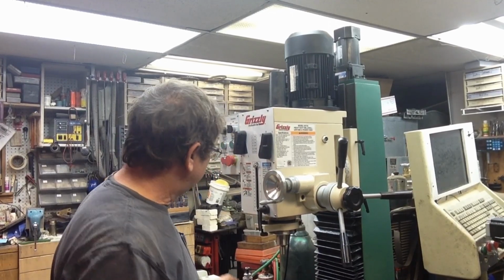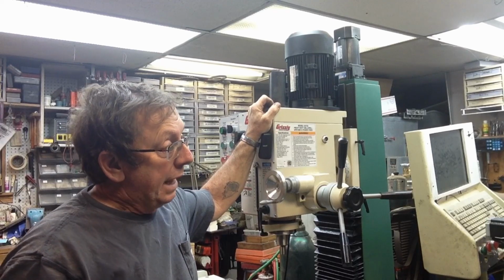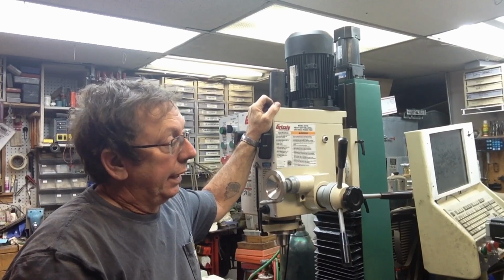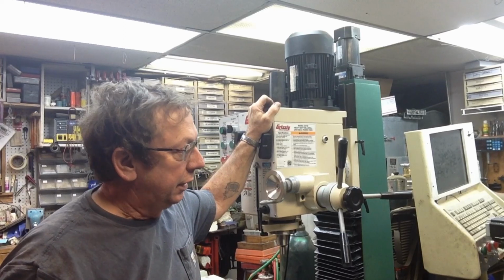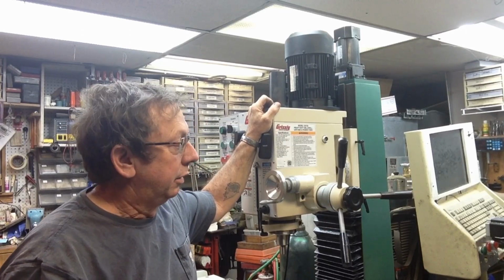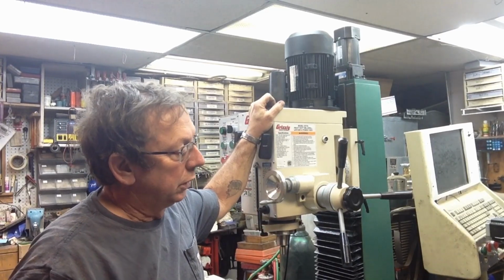Hand wheels are going to change. For digital readouts, I'm going to put Schumatech digital readout on here. For now, I'm going to pull the digital readout off of the G1007. Now, that's the earlier 350 DRO that Schumatech put out as a kit. And we've talked about them before. I've got several of them kicking around on several different machines. On the G1007, that setup right there has been rock solid. That's been a really good setup.